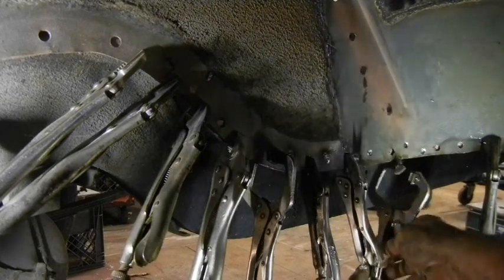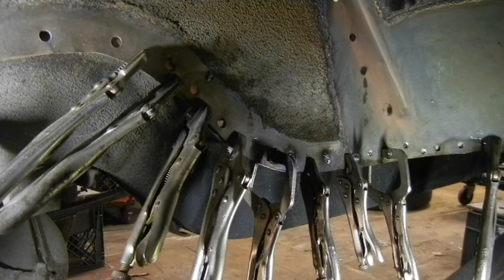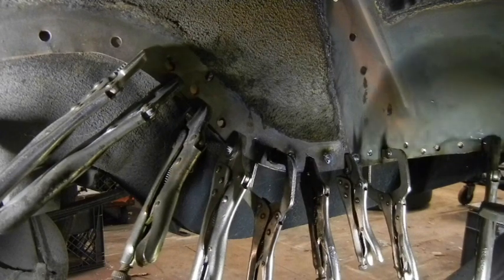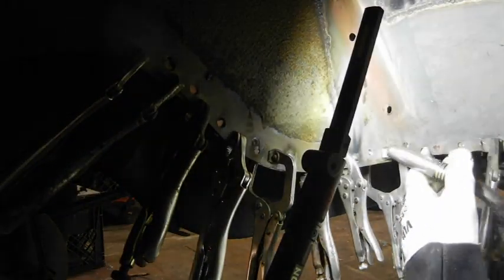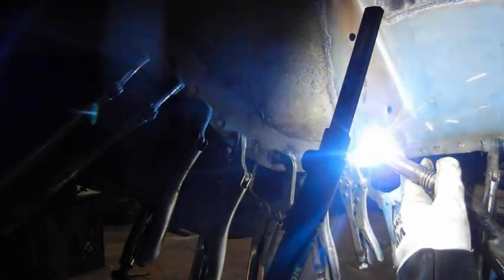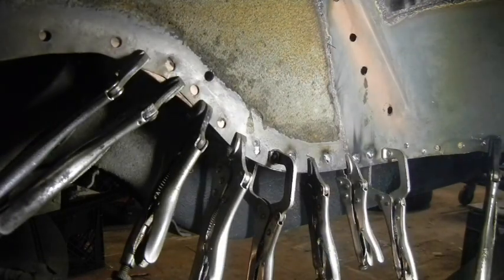Moving the weld, moving the clamps around as I go. Try not to make any holes, but still weld hot enough so it will go in pretty good. Once I get the whole thing done I'll grind it down the back with a little angle grinder — kick-ass little tool that will work pretty good. I'll continue all the way around like that and then I'll grind it down.